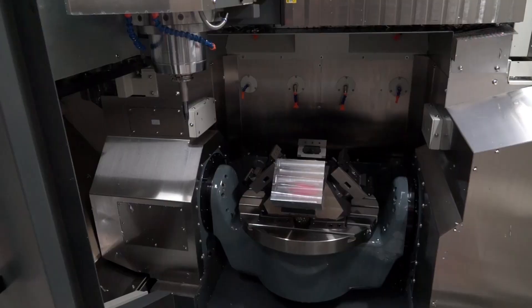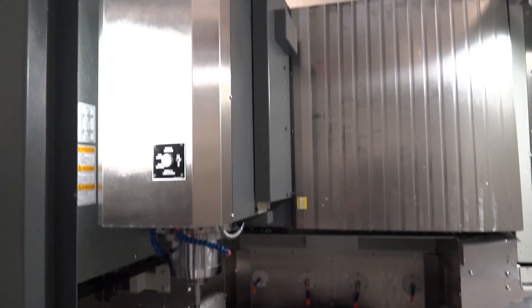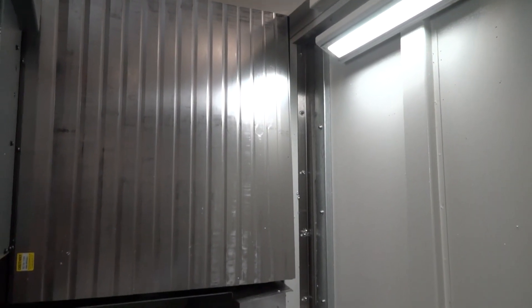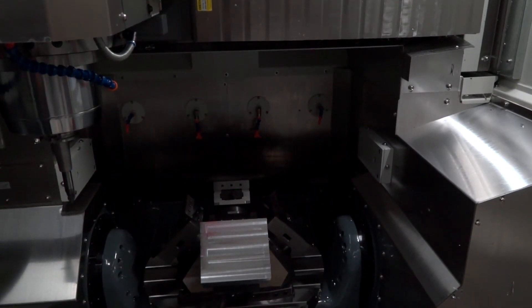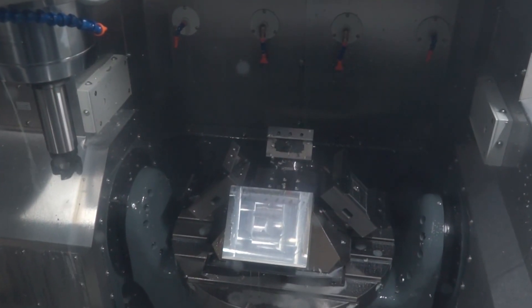When you're moving at that speed you need a stable construction. It's a gantry-style machine, as you can see, which gives us maximum rigidity. With the torque motor on the C-axis providing a very stable rotational drive, and linear rails fitted as standard, we ensure the highest accuracies on the machine.